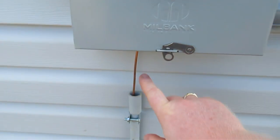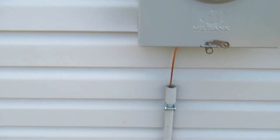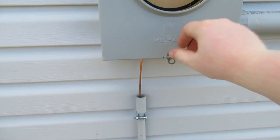This is my own house, so that's what we're doing. One of the things the inspector wanted me to do is I do have to add a ground strip here for other services, such as the phone line and that sort of thing, to be tied in to this ground. That's something I've got to get done before the final.